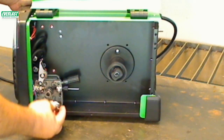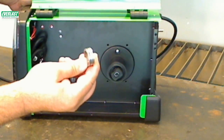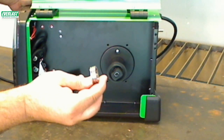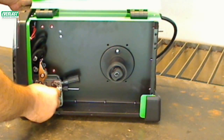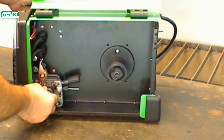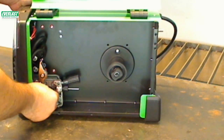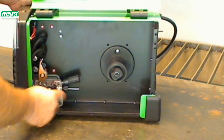The heavy-duty wire feed mechanism is made from cast aluminum and steel. It will support feeding of wire diameters from 0.023 to 0.035 with the stock drive roll. However, for best results, 0.023 to 0.030 wire is recommended. Additional flux core drive rolls may be used and are optional, and are directly available from Everlast.